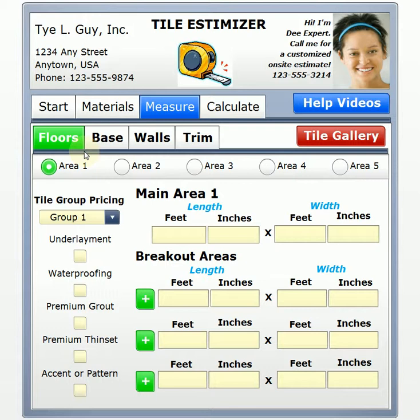There are rare cases where none is needed, but in most cases you're going to need at least some type of underlayment. Waterproofing, again, can be a sheet type, a roll-on type, many different manufacturers and different types, and they are usually for wet areas like a bathroom or a kitchen, maybe especially a laundry room. You'll definitely want that. So if you are just tiling a dining room, you probably don't need waterproofing. If you're in a laundry room, I think you absolutely need waterproofing.